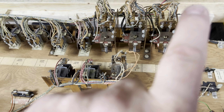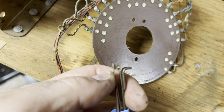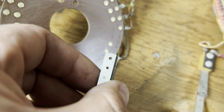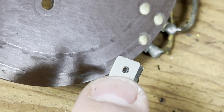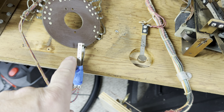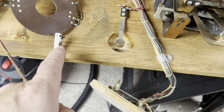I did find one or two spinners on one of these — I had to fix them. Spinners are the contact that's between here. You can see how there's two contacts: there's one on this leaf right there, and then there's a shiny gold one on that leaf. These are riveted on — it's riveted on, just like on the back. Over the years, especially with Gottlieb, they just get loose, and instead of being firmly attached to the leaf, they are loose and then they get a little wiggle to them, or they spin. They actually will spin when I clean them — that's why I call them spinners.